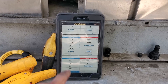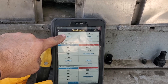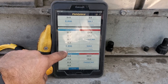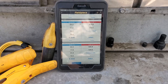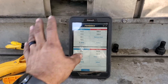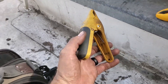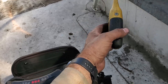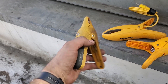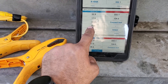I made another adjustment, and I got to say, I really dig the fact that Fieldpiece lets you do multiple superheats. Compressor superheat is 26, evaporator 1 is 16, evaporator 2 is 13. We're going to give it a little more time to stabilize. With the Fieldpiece Job Link system, I'm able to wirelessly connect to the walk-in cooler evaporator that's below me right now. I have the JL3PC temp clamps on each evaporator, and that's how we're getting these measurements.